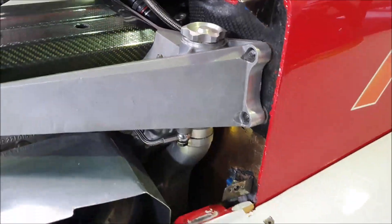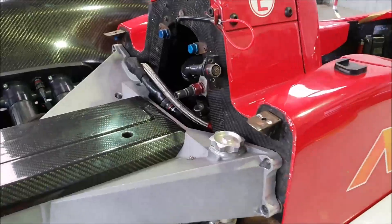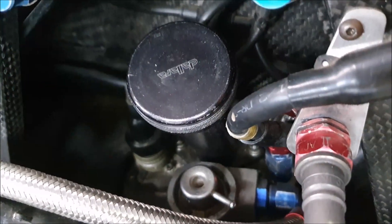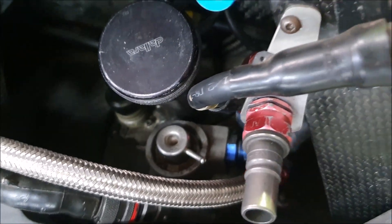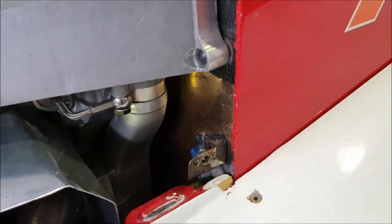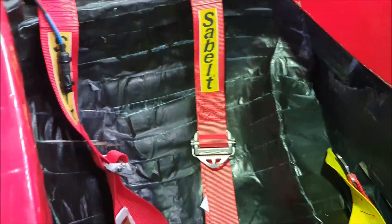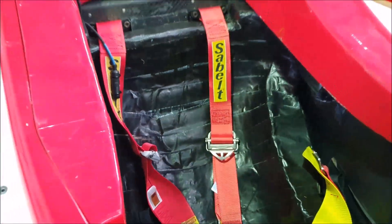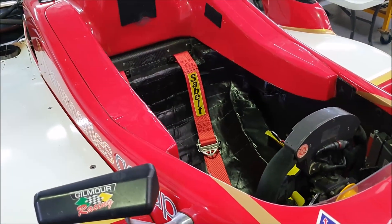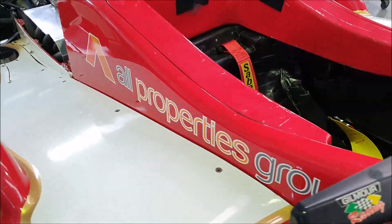What was a little bit unusual about Romain's accident was the fuel tank hemorrhaging. The rear bulkhead has the fuel filler and the fuel pumps mounted on the bottom of that plate, and there's a large bladder that fits on the other side of the bulkhead and actually goes down behind the driver's seat. It's a very thick, heavy bladder completely surrounded by carbon fibre, so it was very unusual for that to hemorrhage.